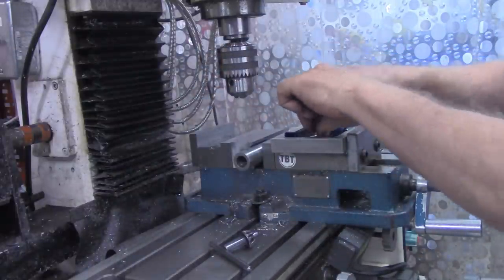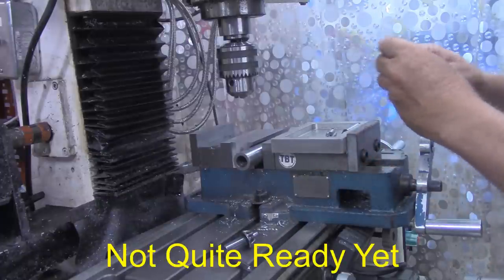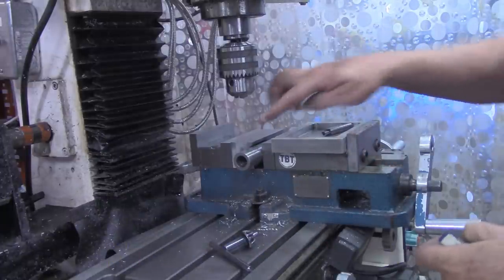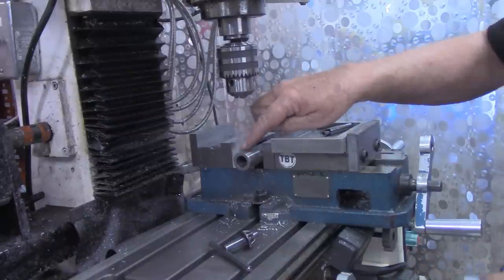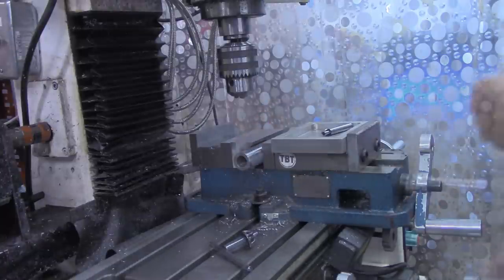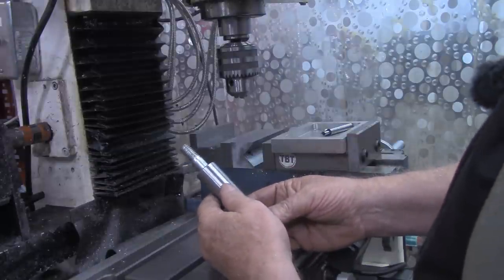Okay, I think we might be ready to go back over to the workbench and put all these pieces together. I'll carry this over to the Scotch-Brite wheel and deburr that little bit. There's one more step we need to do before we go back to the workbench — put a couple of flats on each side of this shaft. We're going to make this three-quarters of an inch.